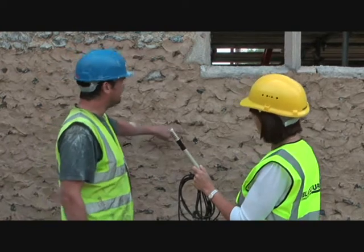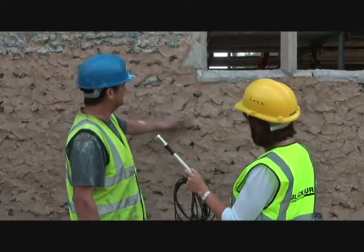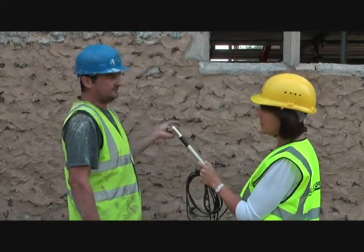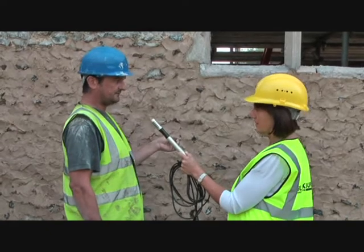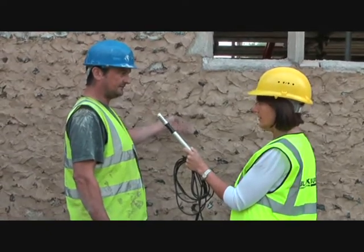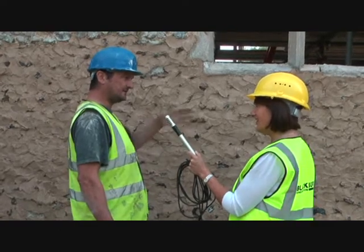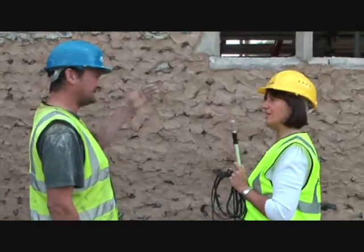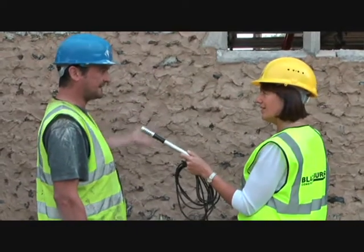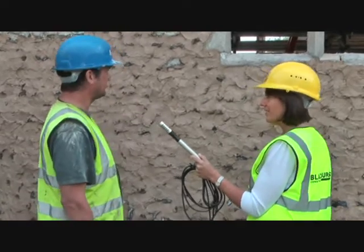When it goes off, once you've brushed it off and you've got a finish like that, it forms a skin, only maybe 2 or 3 mil thick at the most, and that stays. But if that falls off, the stuff behind it hasn't gone off, and then that goes off again, and you get another 2 or 3 mil. So it's almost like layers of skin that will slough off over time. Over time, it will keep getting the skin back on. So if it deteriorates, then you get another skin, and then it lasts a bit longer. So it is good stuff.